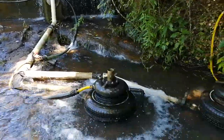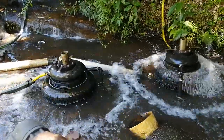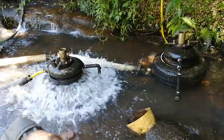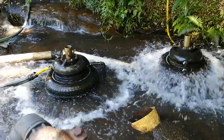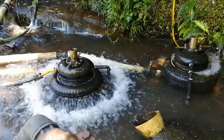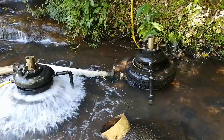The output of the pumps is going to vary depending on what the float valve is doing at the time. If the right-hand pump's tank was full it would turn itself off — the left-hand pump will be producing about 17,000 liters a day if the tank was empty. The other pump would be doing around 11,000 liters a day.